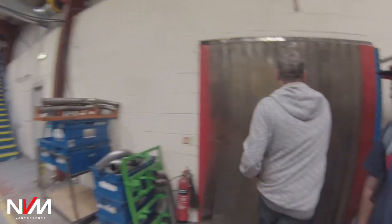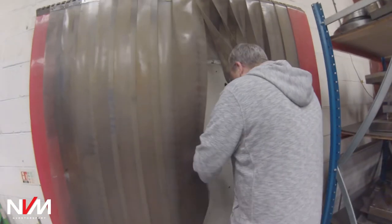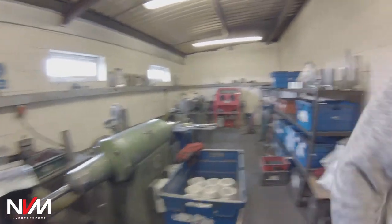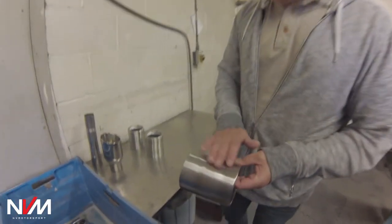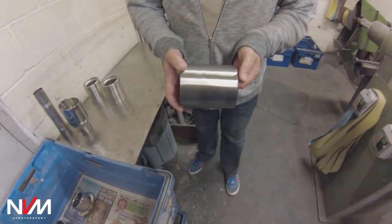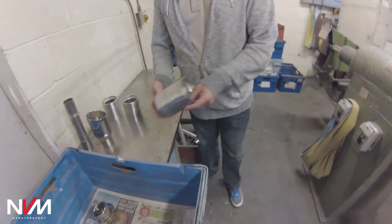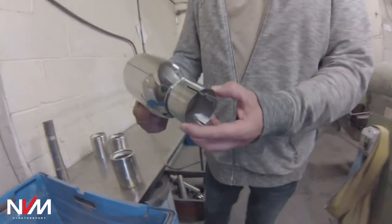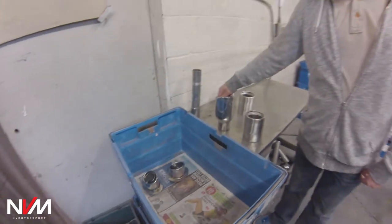So this is the messy bit — I'm going to guess this is the polishing station. This is the polishing shop, yeah. Metal comes in as a raw finish. That guy linishes it first, just to get any scratches out and get that rough finish, and then they buff them up on the mops and get this mirror finish. All done by hand.